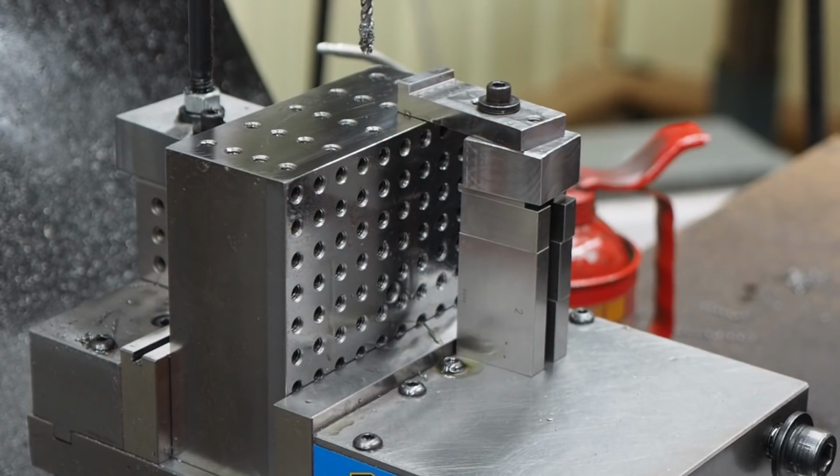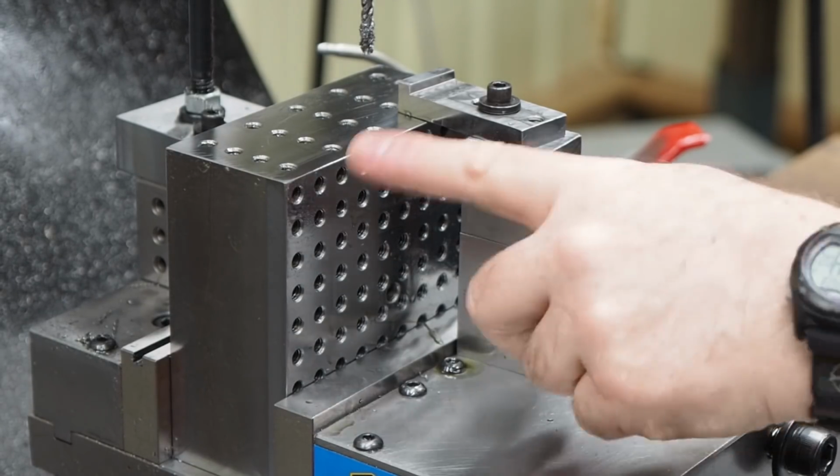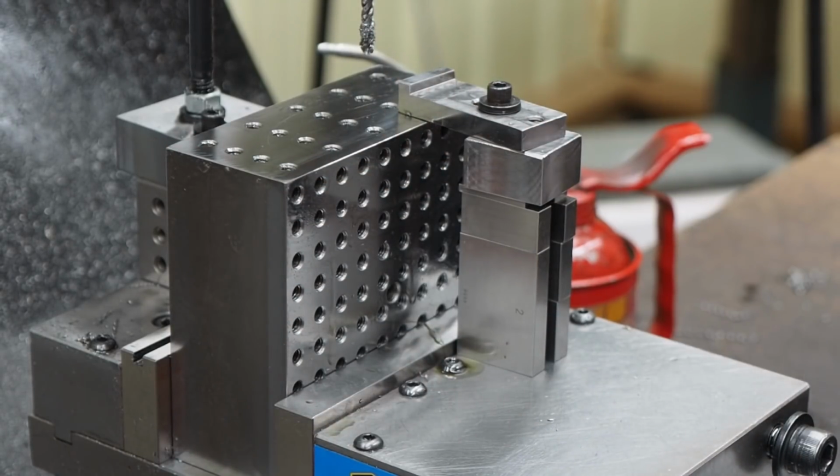I'll have to decide that based on how much time it takes me to finish grinding, and then we can give an update on that. But anyways, if anybody's interested in any of these, give us a holler. Like I say, they'll be under $1,000. They'll be ground extremely precisely. I'm going to shoot for having them less than 50 millionths in 4 inches, or at least 50 millionths in 4 inches. That's going to be the target that I'm going to shoot, that or better.